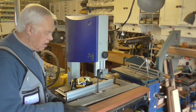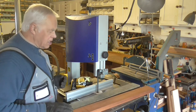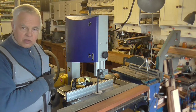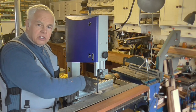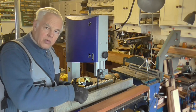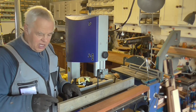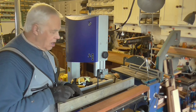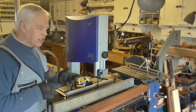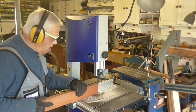There's a piece of oak here and I've got a piece of mahogany. Both of these are out of a skip — they're just scrap items. So what I'm going to do is rip them in half using the bandsaw. You could do it on a table saw — I've got a table saw and that's what I use — but the difference is that with a bandsaw it cuts a much narrower kerf. If you've got a piece of wood that's not too thick it'll save the wood, whereas if you put it on a table saw, because of the tungsten tips, it cuts a larger kerf and wastes more of the wood. So by the time you've cut it in half you haven't got so much left. So bandsaw's better if yours will cope. This one will just about cut through this. So I'm just going to put my glasses on and cut this.